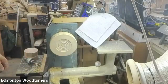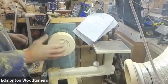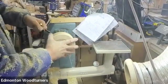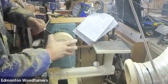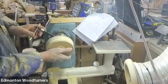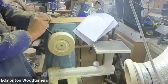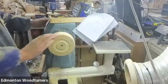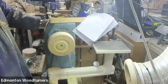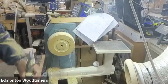Basically, that portion of the bottom of this piece is done, it's finished. I would sand it up to whatever grit. I usually only go to 220, sometimes 280 or 320, but it's a wig stand, and I use Osmo, which is water and alcohol impervious. With Osmo, they only recommend you sand to 150 grit, so going to 220 is fine, and Osmo actually fills the pores and gives you a nice satin, smooth wood-feeling finish. It's a hard wax oil, and that's what I use.